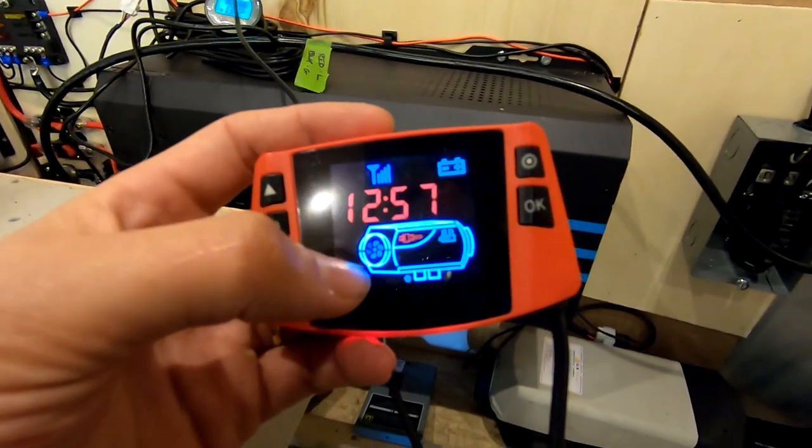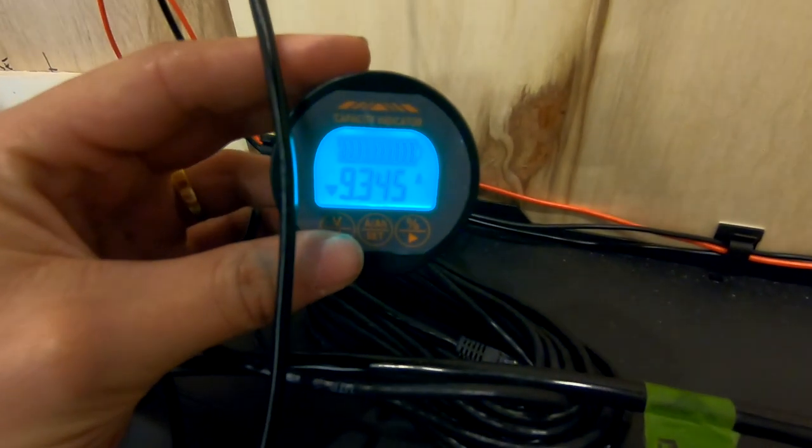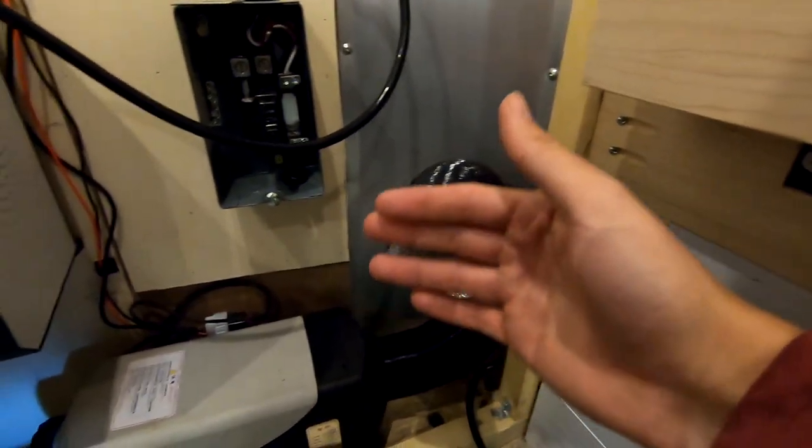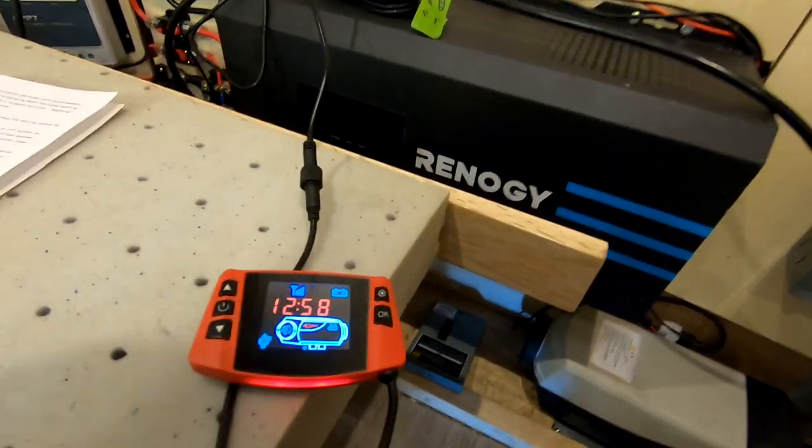And so the glow plug is just warming up right now. It's pulling about 9 amps right now, and that's just to get it started. I can feel some cold air coming through the heater. So it's just sort of setting up. It hasn't started combusting anything yet. You don't even hear the fuel pump going on right now.